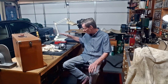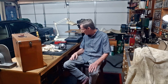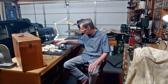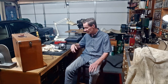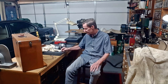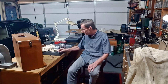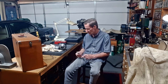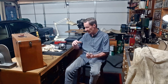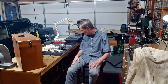Finally after a long haul, you're going to see machining the motor pulley. Whoever designed this thing did a good job — if you want to mount it horizontally or vertically, there's no way to do it easily. You'll see in the video how I clamped it. I had to machine a little piece that goes underneath it, which fits the grooves in the T-slots to keep it straight. I need to make another one though, because it sticks up above the table and tilts the rotary table when clamped. I'll make a longer one with screws to prevent tilting.